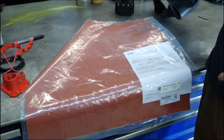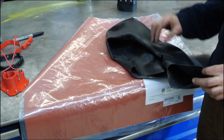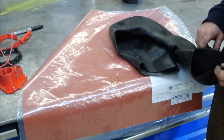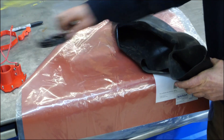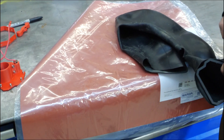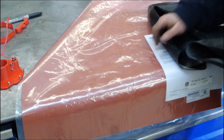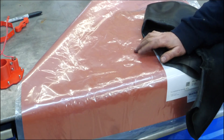Since I bought this sheet, I found that inner tubes from garden tractor type equipment work well. This was a 10-inch European BCS tractor inner tube, and in fact this 10 by 5 inner tube is an almost perfect size for this — you can almost just cut rings off of it. Probably if I had already ruined this tube on my BCS tractor and had it out when I designed this ring, I would not have spent a lot of money on this high-temperature sheet.